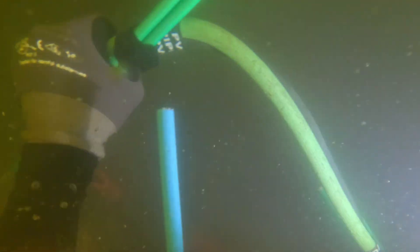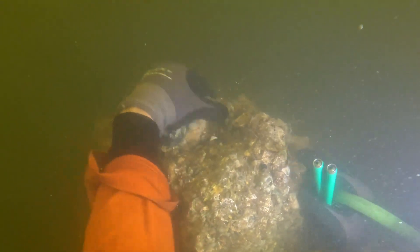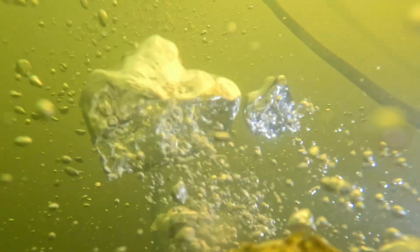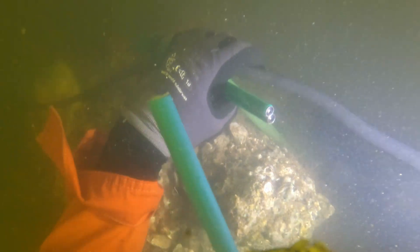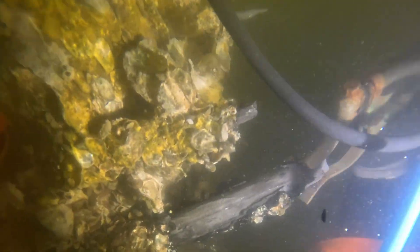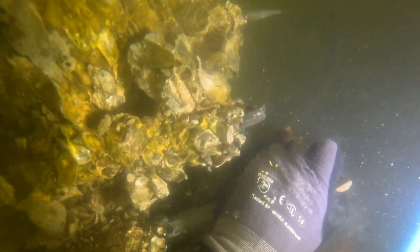That blue air hose dangling with no fitting is actually exactly where it needs to be. That's called the diver's pneumo — short for pneumo fathometer — and it's a super accurate way for topside to gauge our depth. It's also a secondary or alternate air source, because in an emergency situation, if the regulator freezes up on main air, you can actually stick that air hose up into your helmet as a backup air source. Now that I'm repositioned, my umbilical and the burning leads are draped away from me, so no molten metal is going to be dripping on them.